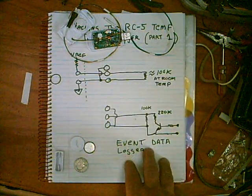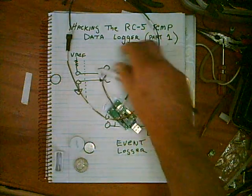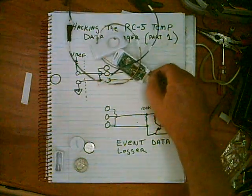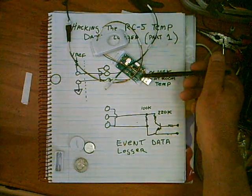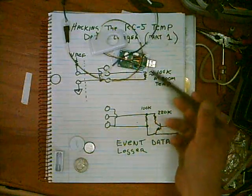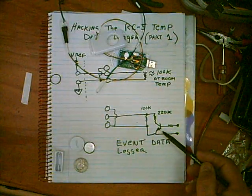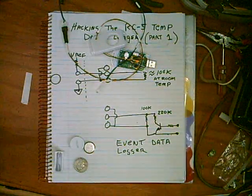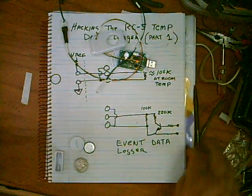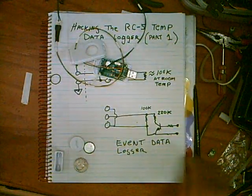This is part one, showing you how it all goes together. I don't think it'll be hard to reseal — maybe just some tape on the side and some hot glue on the wires so they don't pull out. It's going to become very useful just as a temperature monitor now, because you can't get this in some tight spaces, and you don't want to just sit the thing at 60 degrees centigrade — that's just going to kill most batteries. So you get the sensor to a safe distance away, and maybe you can do some temperature and data logging. I'm going to try equating it to voltage and some different things. It's a fun little device — if you want to spend $10 or $15, it's a nice little experiment. Part one. We'll see what happens with some of the other designs. Thanks for watching.